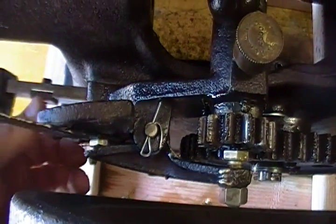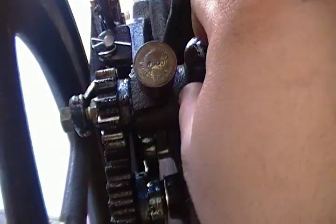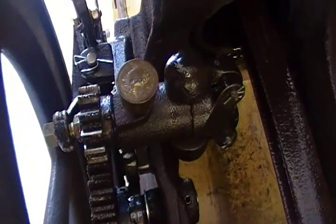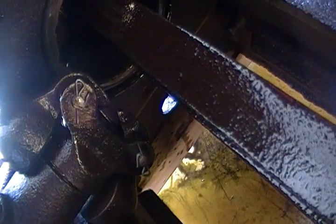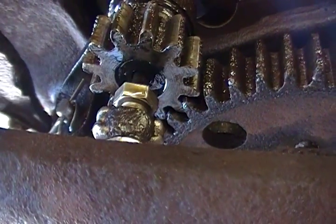You could say I've gone through the latch out mechanism. I put a longer pin going through the governor yoke. You can see it's that pin right there that comes out. I made new pins for the governor weights. They were really worn, more than I thought they were, and I needed to replace the spring in there anyway, so I had to take them out. Made new pins and drilled them just like they were originally, and used cotter pins on them. New bolt that pin rides up against.